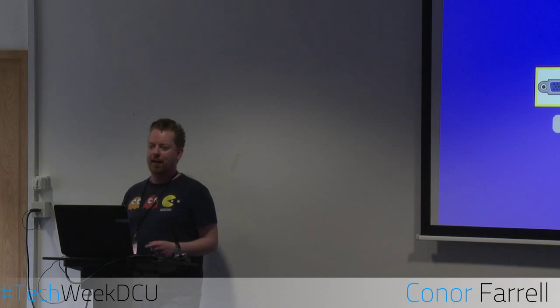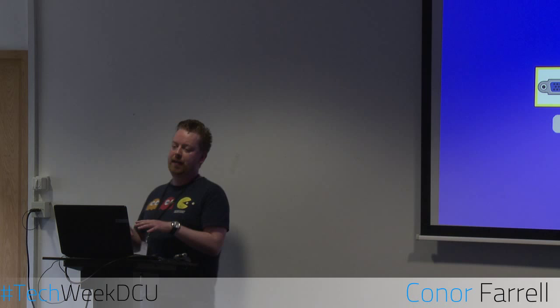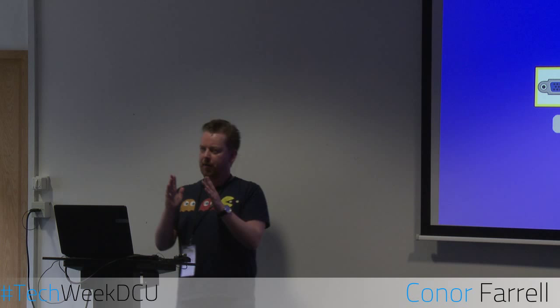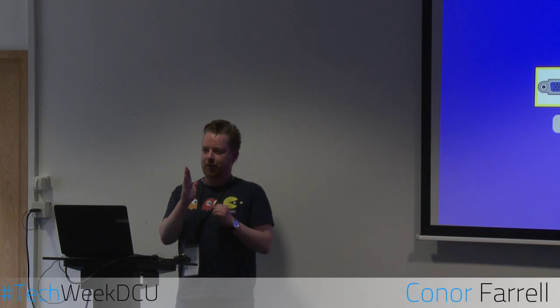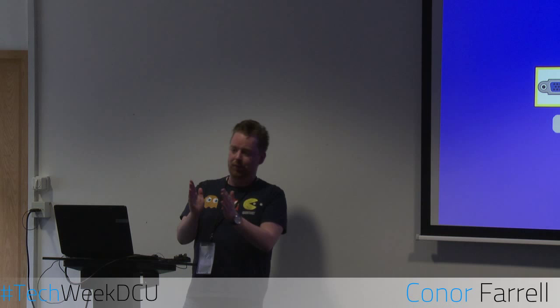Each radio station will broadcast on its own frequency. Okay. Even with the frequency modulation? Even with the frequency modulation, yeah. What you need to do is define the bandwidth. That takes place in the hardware inside a radio. So your radio isn't tuned to exactly 100 megahertz. It's centered on 100 megahertz, plus or minus a few kilohertz, maybe. So when that station is transmitting, the frequency will alter over and back slightly. But because your bandwidth takes in that whole section of frequencies, it can pull in all the information.